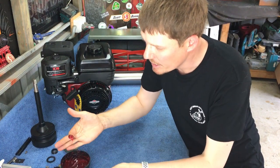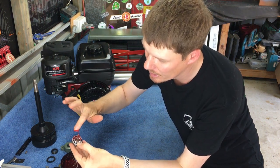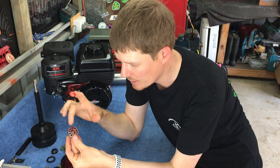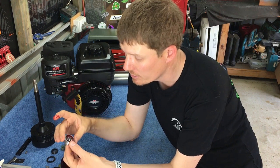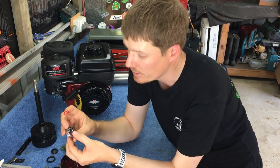all I do is dip my finger in here and then I just push it, literally just push it into the side of the bearing. And then as you do that, what that does is pushes around all the little actual ball parts of the bearing. And that's how it's done. So I'll quickly do that, and then I'll flip it over and I'll do the other side, and then we should be right to press that into our bearing holder.